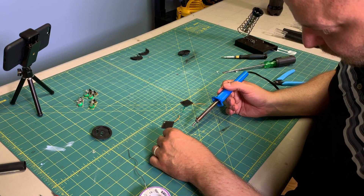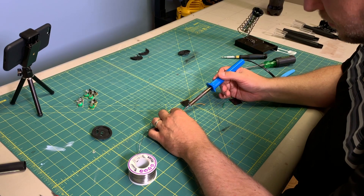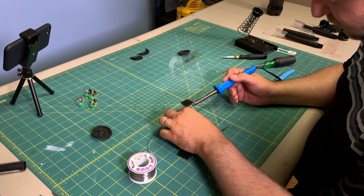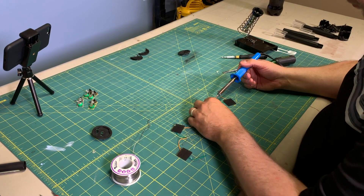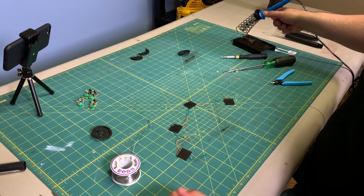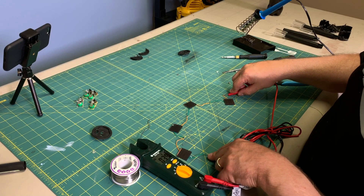To show how you can combine these to create more voltage, I'm simply going to connect them in series — positive to negative, positive to negative. So three jumpers in between and all four of them will be connected in one series circuit. By combining the voltages, that one to one and a half volts gets added together, giving a final reading of 3.9 volts with light shining on it.